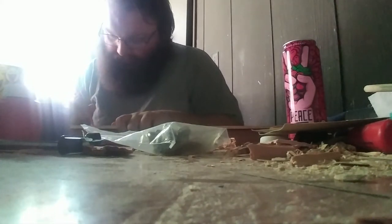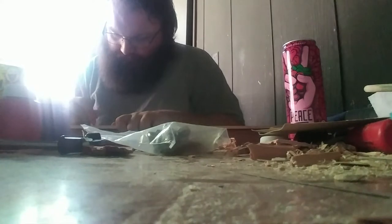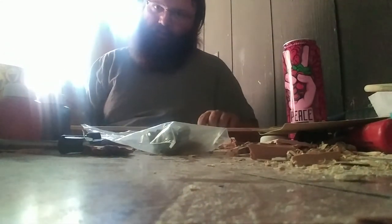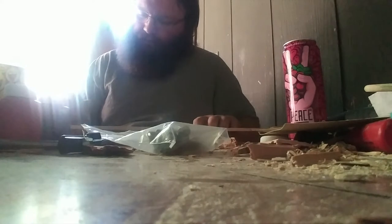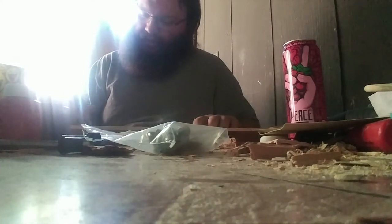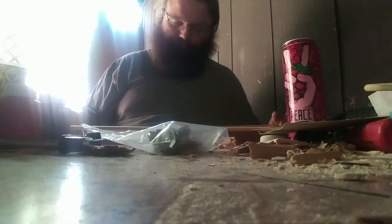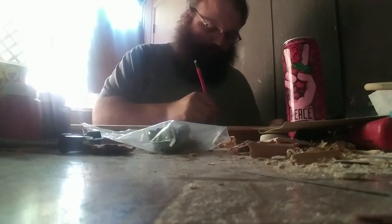So I'm going to mark that 8.25 inch. Okay. Now, I want to leave about 1/2 of an inch of stock below the can, where the can's going. And much like I did on this other one, I'm going to curve down to about 1/2 inch or so for where the tuner goes. Even marking it by eye.